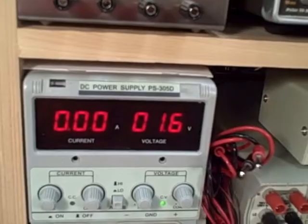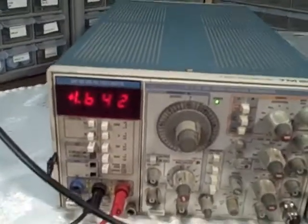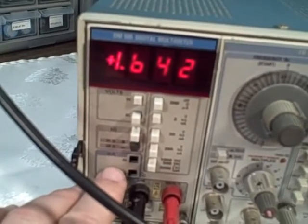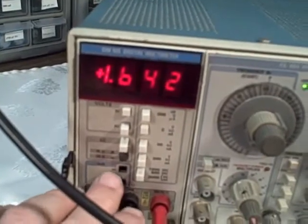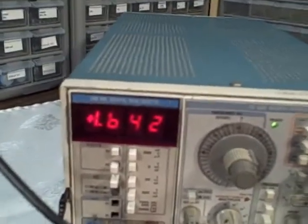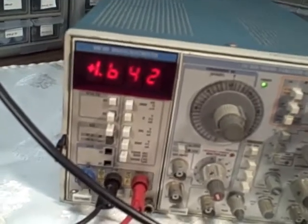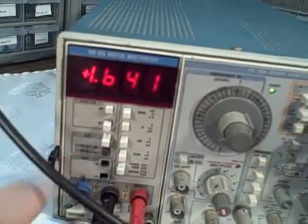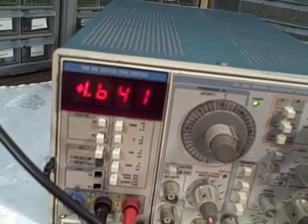And 1.6 on the power supply. We are missing a couple of the push rods here on the milliammeter section of the digital multimeter. The switches are inside — if you were to reach in with a screwdriver you can actuate them. But obviously at some point you'd like to try and come up with a new plastic switch actuator push rod.